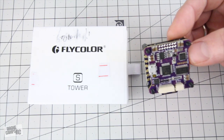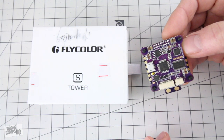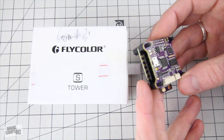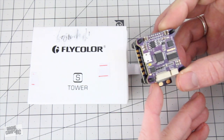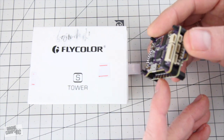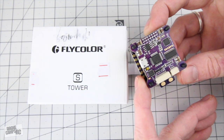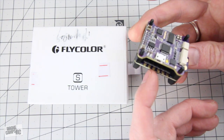Welcome back to the channel. I have something new on the bench to show you today. If you're thinking about doing a build, maybe one of your first builds, this is a really easy way to do it. All you have to do is connect your camera, your VTX, and solder up your ESCs and the battery cable. It's probably one of the cleanest, quickest builds you can do using an all-in-one stack. This one incorporates the PDB on the very bottom and the ESCs all together, so you have a really nice clean build — no ESCs out on the arms, just motor wires running to this bottom board.